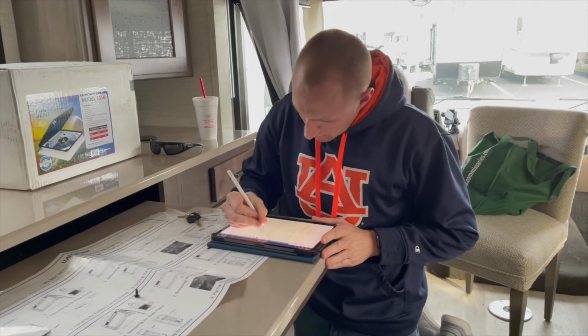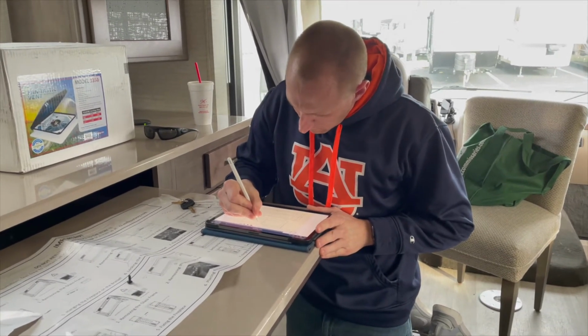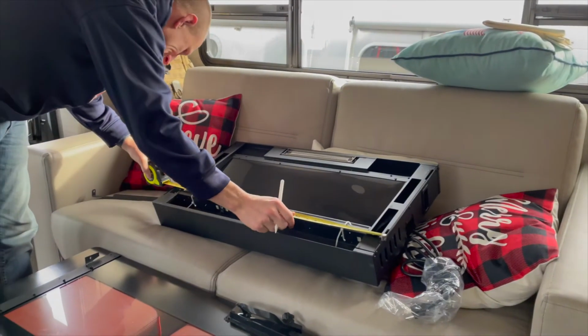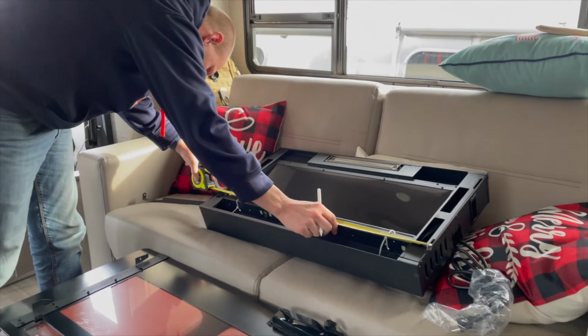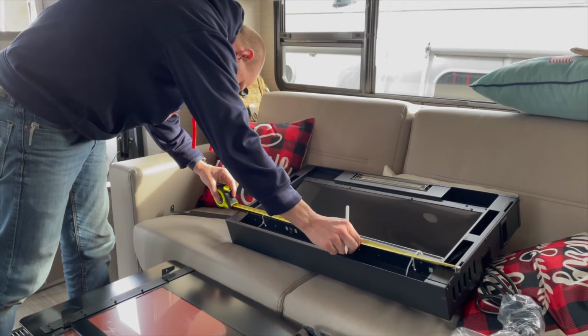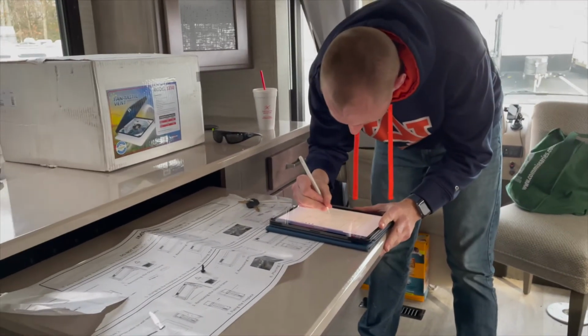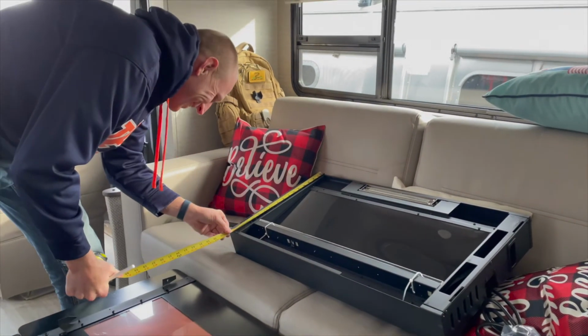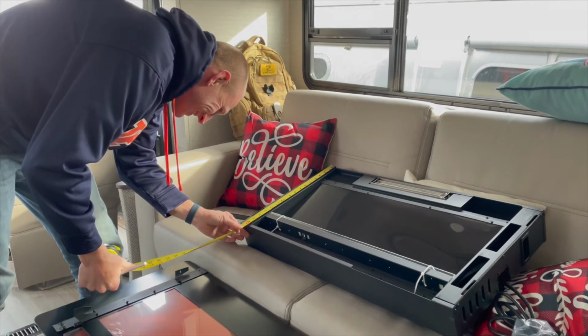We don't put it to bed at the end of the summer. So a fireplace, always having to rely on the propane heat, or our air conditioners also have heat pumps, but they're very, very loud, and they honestly don't work all that well. The way a heat pump works, it's only effective down to around 45, maybe 50 degrees. So winter here in DC dips below that for several months in a row.